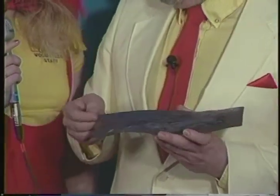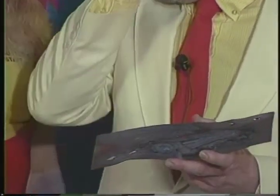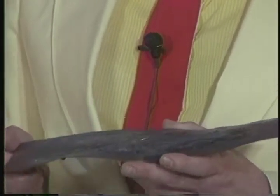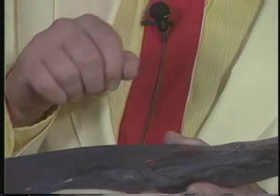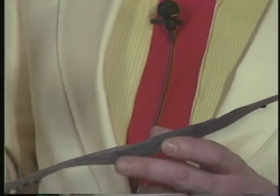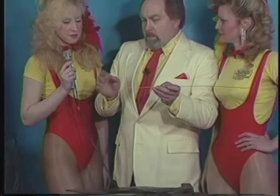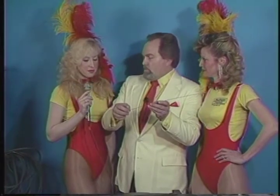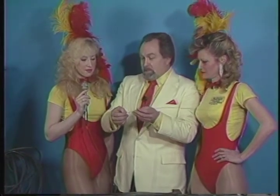Actually adding a little filler rod, right? Right. And what did you find out when you started sticking the filler rod in there? That the filler rod sometimes stuck to it and you had to yank it back and forth. Yeah, exactly. With a little light piece like this, it actually yanked the piece, and it was a bit of a pain in the neck. But the idea is that when you're adding the filler metal, you have to develop a rhythm of sticking the filler rod into the leading edge of the puddle, and you learn after a while how far to stick it in and get it out again real quick. Because if you stick it in too far, leave it in too long, the rod cools the puddle, and essentially that becomes part of the steel then. Right.